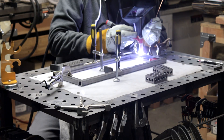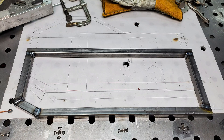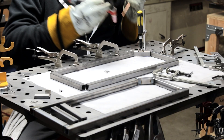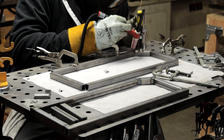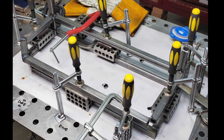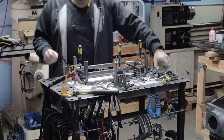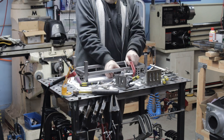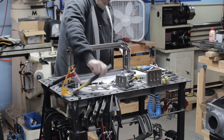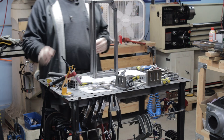This will be the third time I tried to start making this. I cut and cleaned the individual bars, lined them up on a drawing placed on my welding table, clamped it down, and tack welded the assembly up. I did the first two layers separately and then stacked those up with spacers and welded those together with the corner tubes. Some creative clamping was required — turning the whole cage vertically and hanging it off the side of my welding table helped.